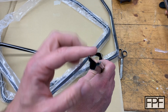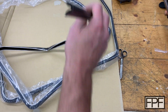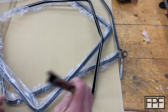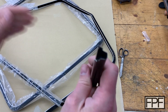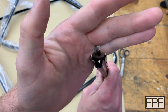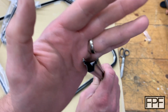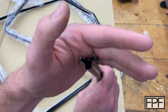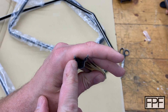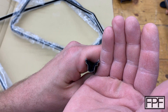It's going to be a fair amount of estimation because I don't know — it was probably bent like a roller die, and the material I'm guessing shifts a bit because it's not consistent. If we look at this end and then we look at another end, it's a little bit different. And if we take a look at one pulled out of the package, it's also just slightly different. Some of that's probably from the process of trimming these and from going through a roller die and then some sort of a large press or combination of dies. I'm going to get rough measurements of the section that looks the most even and try and estimate what these curves are here and make up two dies — an inside and an outside.